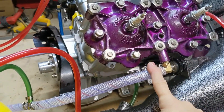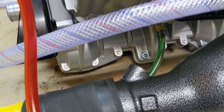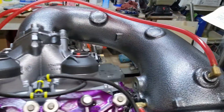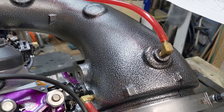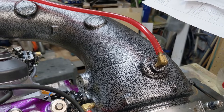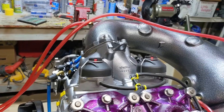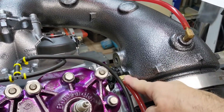The water goes through the water jacket in the pipe, into the manifold, into the cylinders, and comes out here on top of the head. The green hose at the bottom is the cylinder drain — that's on all the skis. Those cooling system indicators can also double as a bleed. They're just points where water can exit different parts of the pipe, but we usually use them as what we call 'pissers' — indicators that go out to the back or side of the ski so you can see that your water is circulating.